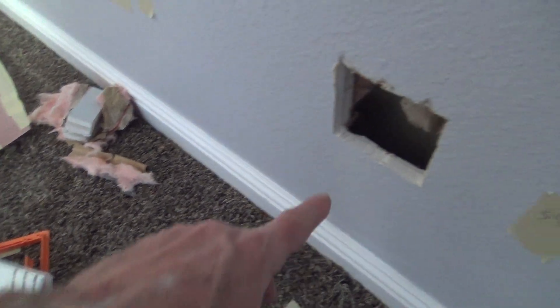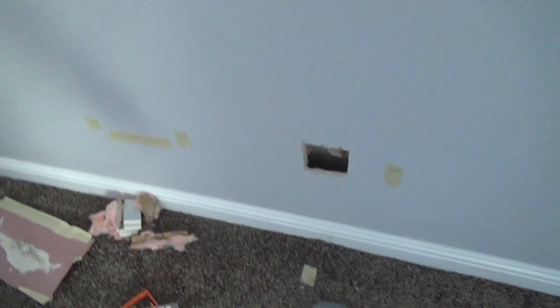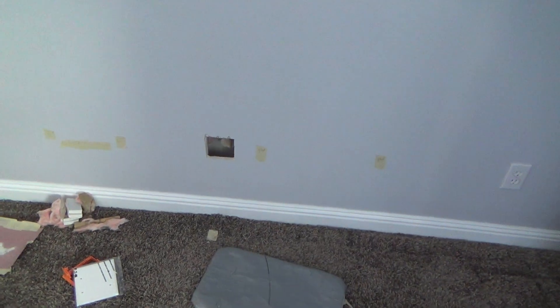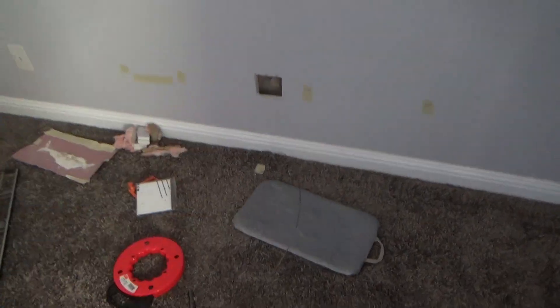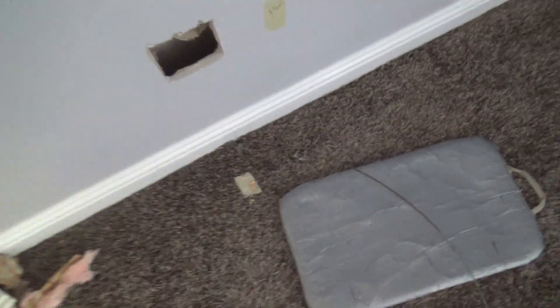After I got the new drill bit, I made four different attempts with this long flexi bit, pushing it down in there. This wall is different than most — it doesn't have a double bottom plate because it's a tenant separation wall. We're on the second floor; there's a tenant on the other side with a garage below. That wall goes from the ground all the way up to the roof, and I'll bet the sheetrock goes all the way up too.